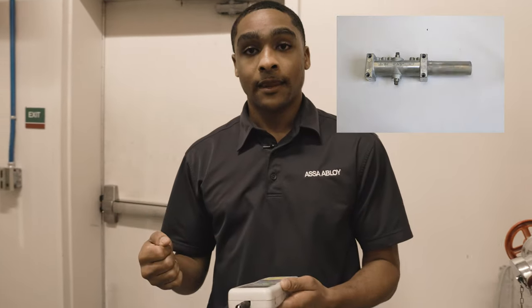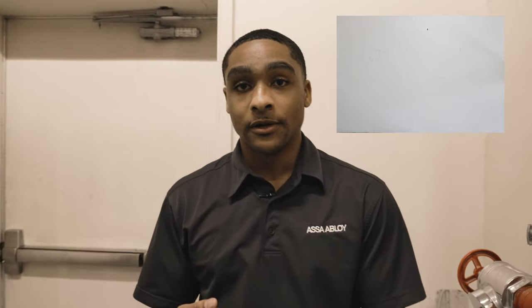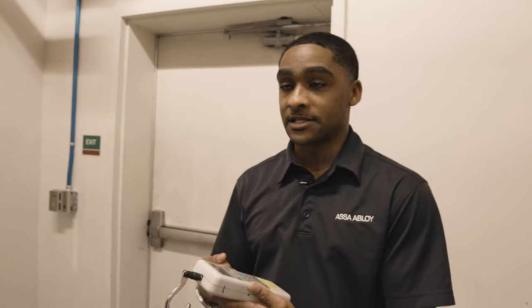It's rack and pinion technology. The way the closer works under the hood is: there's a spring, a pinion, and a piston. As I'm opening the door, I'm compressing that spring. So the more I open the door, the more tension or pushback there is on me as I continue to open it more. Conversely, as that door gets closer and closer to latch — as it's almost closed — that spring is almost fully extended. Now that we've adjusted the spring force so that it's easy to open, there's not enough energy left in that spring to get the door to close.